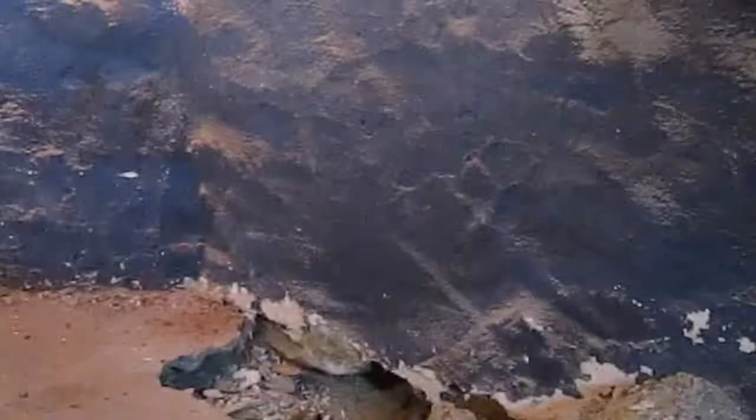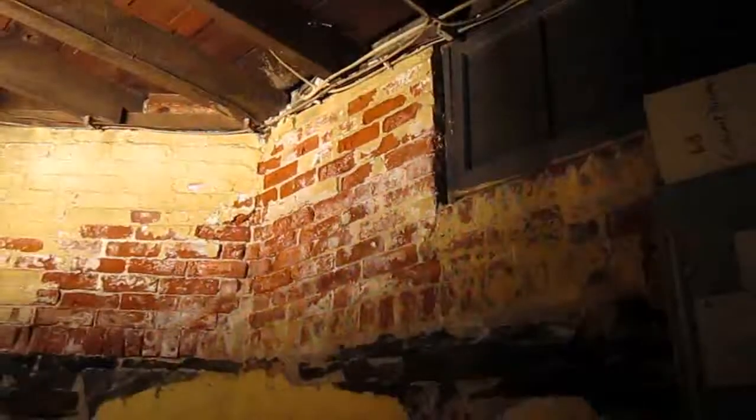Close to the center of the camera you can see a piece of slate — that's the bottom of the foundation sitting on the sand. Behind the plaster up here we have probably four feet of slate as the main foundation wall, holding back the pressure from the exterior grade. Then we transition over to brick, which is probably about another four feet up, and then I want to show you how the wood sill sits on top of that.